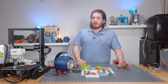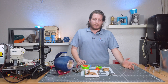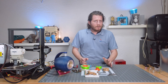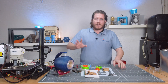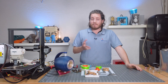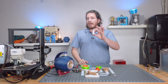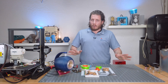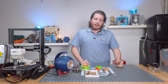You're not going to be filling a room full of dubstep wub-wubs because it's a full-range speaker — give it some credit. But this thing sounds really, really good. It's a great project for most anyone who can sit for three hours and build one — that's about how long it took me the first time. The second time, a little over an hour. We did cheat by using chemical bonding agents like methylene chloride and 3D Gloop instead of the PVA-style wood glue that Paul includes, because wood glue takes too long to dry and I don't want my stuff ever coming apart.